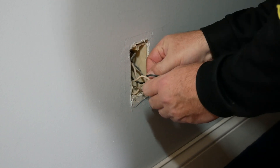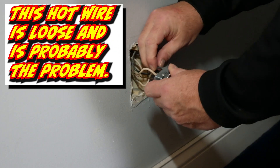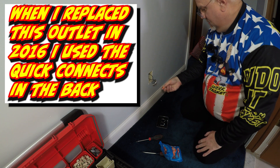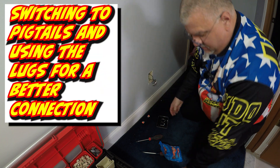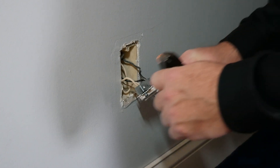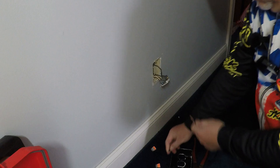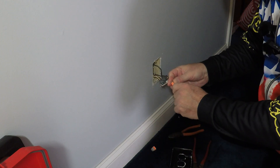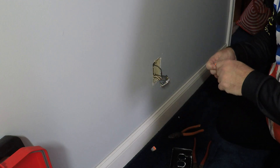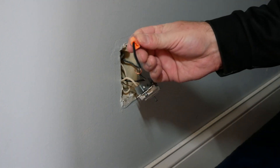Alright, so now we need to inspect these wires here. We have connectors here, so we'll create a pigtail with those. So we just need two. I'll bend this guy around - this will be for hooking up to the outlet. Alright, now we'll cut off a section for the pigtail. Okay, and we'll insert that in here. So that's part of the pigtail.